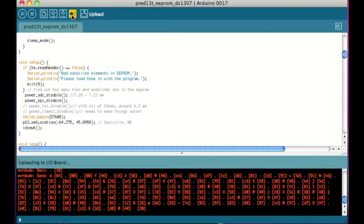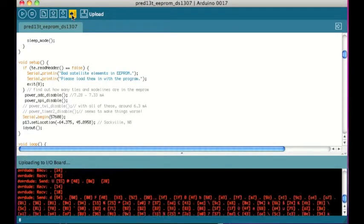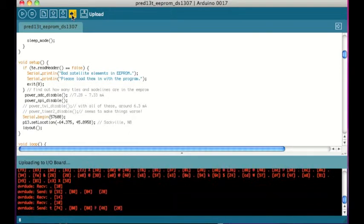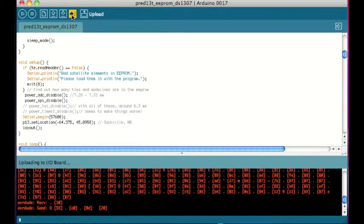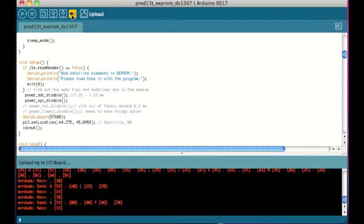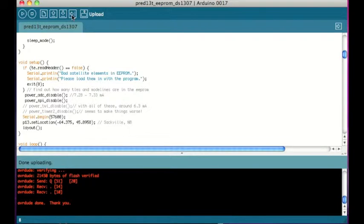On the software side, Arduino is a cross-platform programming environment that compiles your code into ATmega software and loads it into the processor. The programming language is C, but the environment simplifies some of the details for you. With the $4 ATmega 328, you get 32K of programming space and 1K of EEPROM in which to store values. And this is more than enough to do some interesting satellite-related programming.